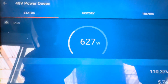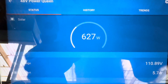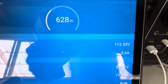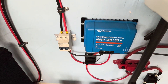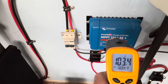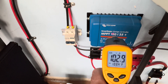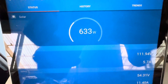Here we're looking at a 700 watt string, pretty much full sun. Those panels drop off a little bit from their full capability under full sun, so 628 watts — they're pumping a full 112 volts into the Victron MPPT 150/35. Let's take a peek at that: 103 degrees. Not bad, just as it's supposed to do, and that's under full sun.